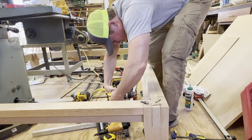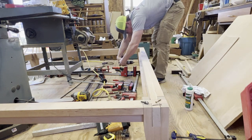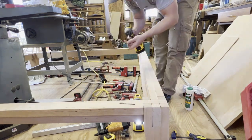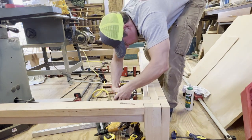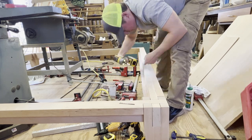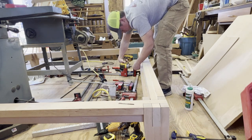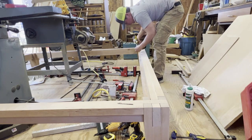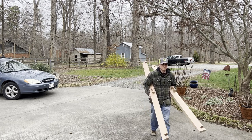Then I ripped down some boards for the side braces. I glued it — glue is very strong — then tacked it in place with some brad nails. I pre-drilled and took several screws to screw them to the sides, and did this to both sides. The footboard and headboard will get a brace down the middle of the bed, and little brackets that I measured out and cut from scraps.